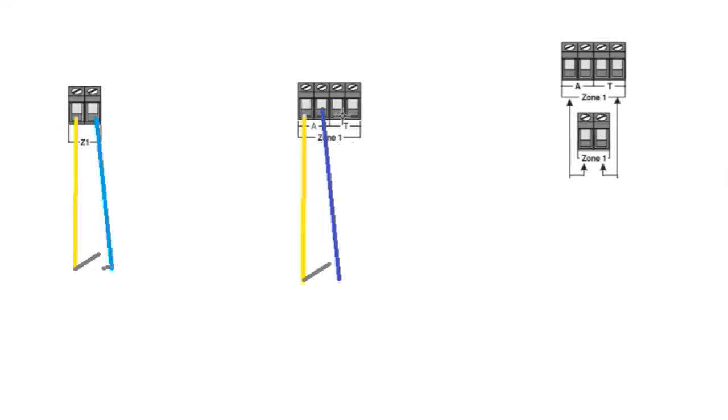So if it's a grade 1 contact, i.e. it's got no spring, it's got nothing, it's got no anti-tamper device, the system will only be a grade 1. And basically what people do is just link it out, either here, or if they link it out in the detector, they basically put the two colours together. So for our argument's sake, we'll use green as one side, and then we'll use this light grey as the other side. And then what will happen is, in an ideal world again, this should go through a spring, basically. And if the spring was to be opened, the tamper would go off for zone 1. It's much like what happened on the zone on a single pole, but basically what you wouldn't know, as I said, what zone will go off. It would just be a global tamper, which we'll get into in a minute.